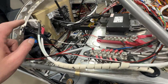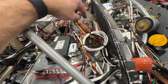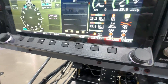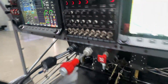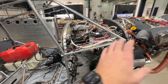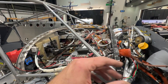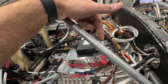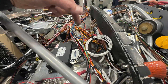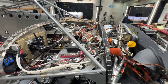The way I wired my alternator — there are a couple of ways you can do the shunt. I chose to run the wire from the alternator to one side of the breaker, out of the breaker to my shunt, and out of the shunt to the bus. With this method, I will see zero amps indication when everything is powered up but the engine isn't running. As soon as I fire up the engine, I'll see the alternator output — when the battery needs charging I'll see that, and I'll see current draw to all the avionics and ignition. I could have run it off the bus and gotten a negative value, but I chose it this way and can change it later if I want.